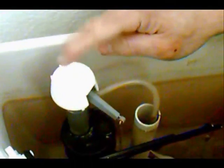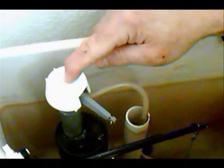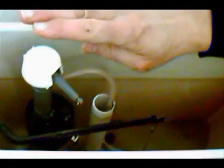Then go back down to the main water valve and turn the water on — counter-clockwise turns the water on and the toilet will fill up. This is a Fluidmaster valve. This valve is 10 years old, the seat is 10 years old, and I've had hardly any problem with this toilet. Typically these valves will last forever unless they get dirt or something in them. The Fluidmaster valves are very simple to replace, but I don't really think you need to spend the money to replace it because they last almost forever.